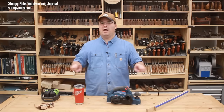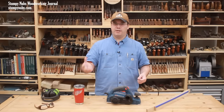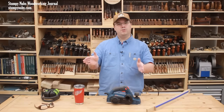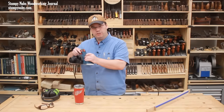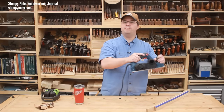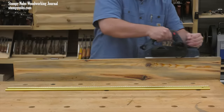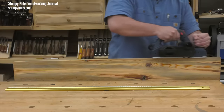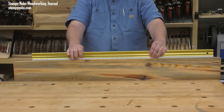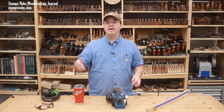Of course, these instructions are for planing the entire edge of a board from one end to another, assuming it's already fairly straight. There are times, though, when you may only wish to plane a portion of an edge. For example, this edge has a crown at the center. It wouldn't be safe to place a crooked edge like this against the fence of your table saw to make a rip cut, because the board may shift and bind mid-cut, and a kickback could happen. The short length of an electric planer makes it difficult to fully straighten a long board, because the tool will want to follow the curves in the board like a boat on the waves. So instead, I'll take one very shallow short pass in the center of the edge. Then I'll take a slightly longer one, and then a slightly longer one, overlapping, until the final pass covers the entire length of the edge. Because I took more passes at the center than out towards the ends, the board should be straighter than it was before. If more work is needed, I'll repeat the process, layering my passes and feathering the edge out until the crown is gone, and I can safely rip it on my table saw.